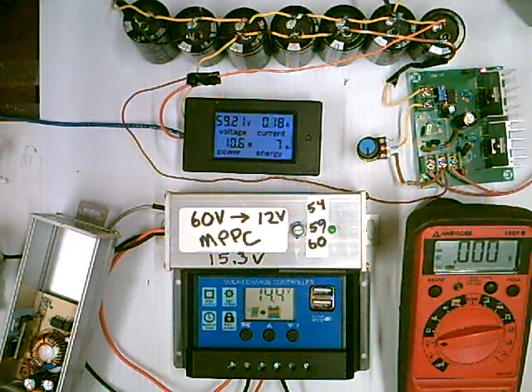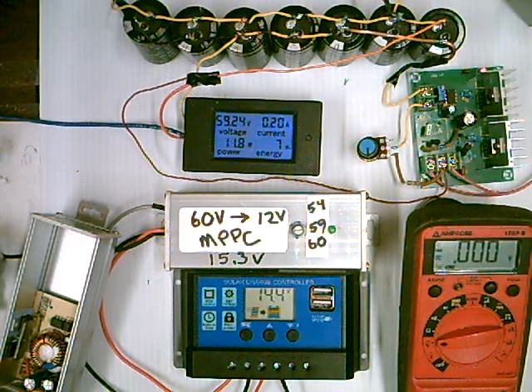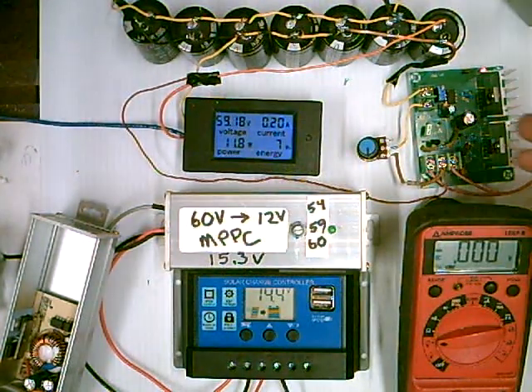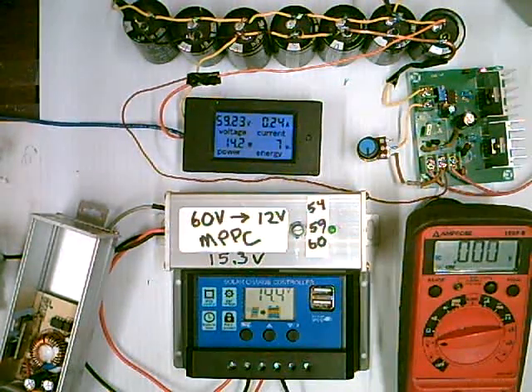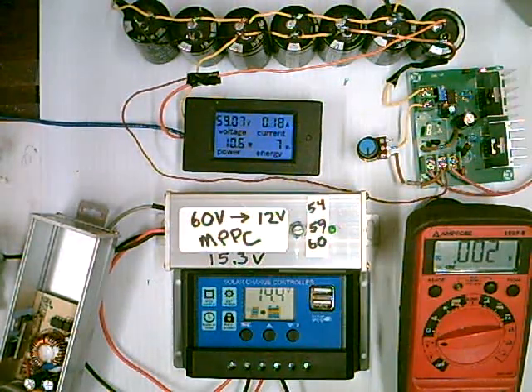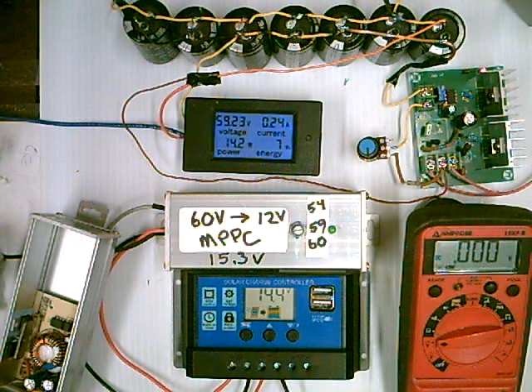So you don't have to spend a lot of money, and you can have a lot of the benefits. This is a nice little system for a camp — it's really nice to have hot water. I have an EcoSmart, it's a six-gallon unit with a 1,400-watt element. And that 1,400-watt element works pretty good at 60 volts.